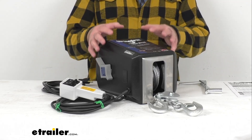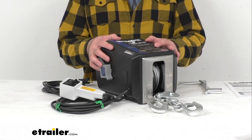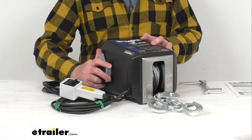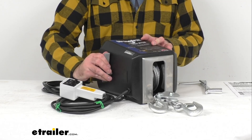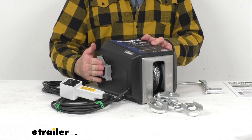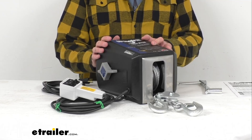The dynamic brake helps bring the load to an immediate halt without coasting, and the mechanical brake locks the reel to hold the load. The spring-loaded clutch lever allows you to release the load without power, providing smooth load control from the locked position or the free wheel position.